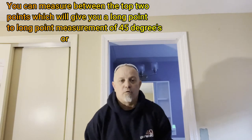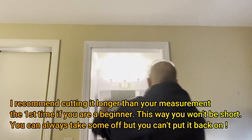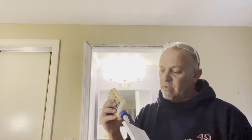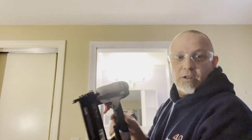Check out my other video on how to cut 45-degree angles if you want to make sure you're doing that correctly. This bad boy goes in — it gets glued, it gets stuck in, it gets shot from the angle, and then shot through the face. Titebond II — you can use any kind of wood glue, but I'm using this one because I have it. Wood glue on your 45s — totally recommend it, because if you don't, you're going to nail this thing up and if you don't prime and paint it and caulk it right away, it's going to separate. Even if you do paint it, it might open up a little, so wood glue will help it not open. I'm going to use the brad nailer — the nails are a little smaller, they're inch-and-a-quarter — I'm going to shoot this thing from the corner just like a picture frame.